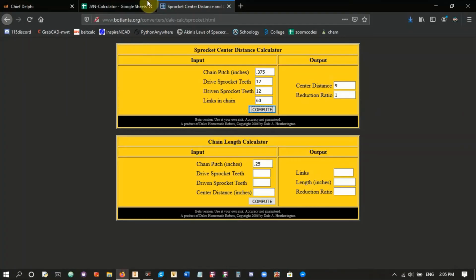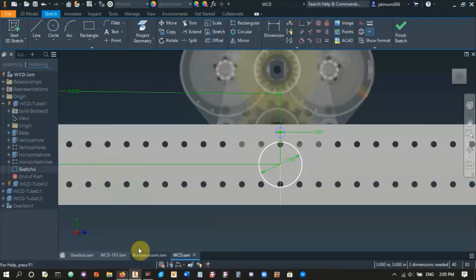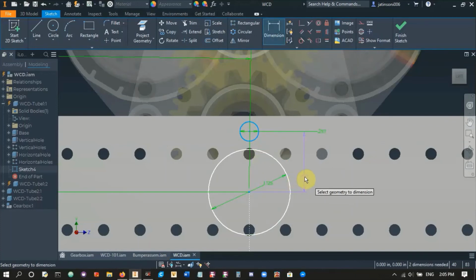I'll put a link to this chart as well in the description, but if you can't remember the screw sizes, like the diameters for the holes, you go to this page, and 1/4-20's close fit is 0.257. Right, so back here, 0.257. We'll make it vertical with the center hole and dimension it to be just how we did it on the gearbox second plate, 1.875 divided by 2, because we want a circle with a diameter of 1.875. So we'll have this radius here.